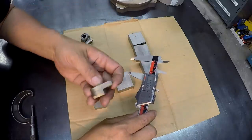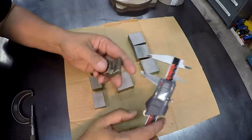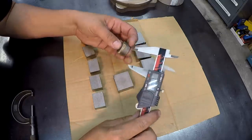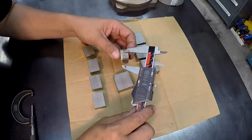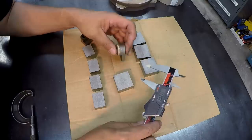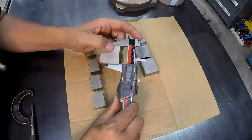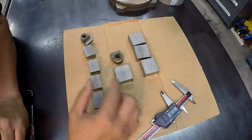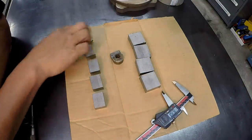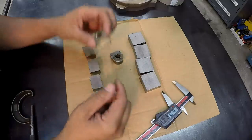These appeared to be some kind of cast, I don't know, maybe they were cast. So we're gonna make them 1 1/8, and that's a 9/16 radius right there. So that'll be important when we're gonna use a radius tool, a corner rounding mill, to make this radius right there. So we'll just mill these down to 1 1/8 using the same method that we did right there. And then after we do that, we'll move back over to these and continue on and start getting our radius milled on this side right here.